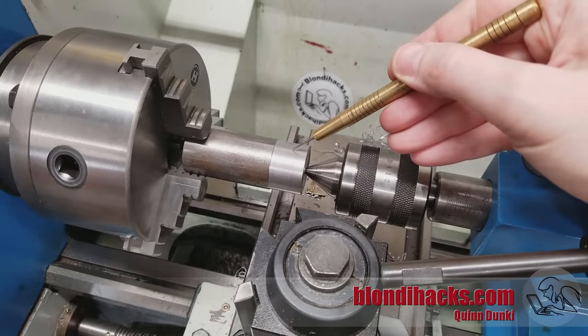There's one more tool in our surface finish arsenal: cutting fluid. Cutting fluid improves your chip action and also helps clear chips away from the cutting tool so that chips from previous passes don't scratch up the material. When you're really worried about surface finish, a little cutting oil will always help — I like Tap Magic for steel, and for softer materials like aluminum, copper, and brass I like WD-40. Cutting fluid is also useful in roughing passes because it burns off and carries heat away, keeping the temperature down on your cut, so cutting fluid is never a bad idea.